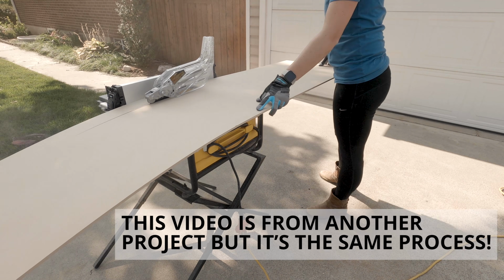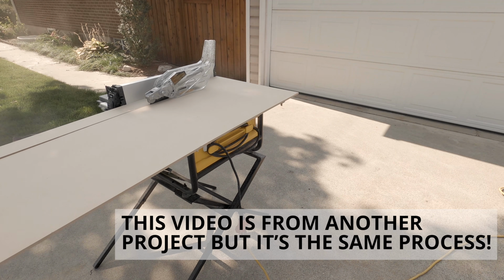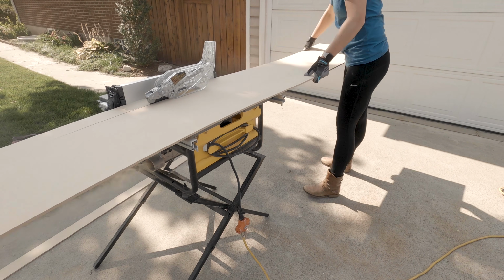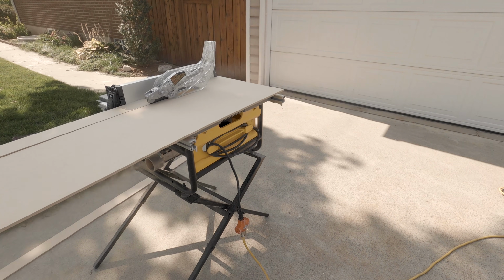Once the trench was dug, I built the forms to hold the concrete until it is set. The boards used to create the form will need to be anchored to wooden stakes to hold them into place. I started building the forms by cutting a 1/4 inch sheet into 3 7/8 strips, because this would give me 12 8-foot strips per sheet. This is factoring in the blade width.